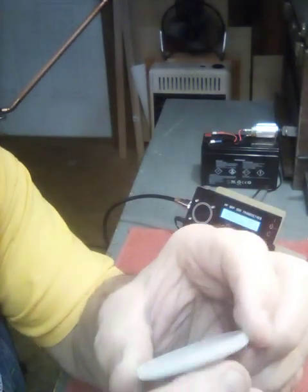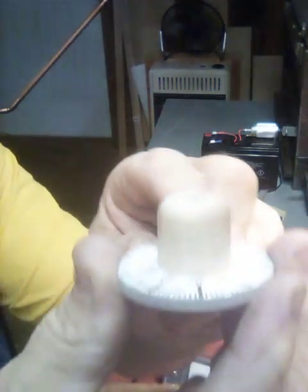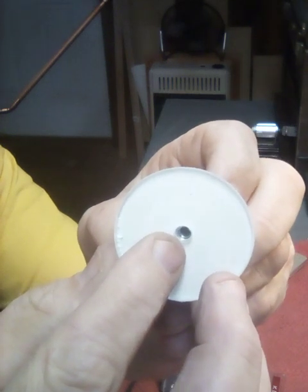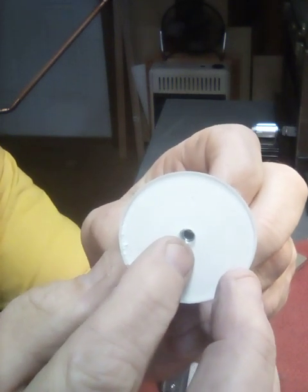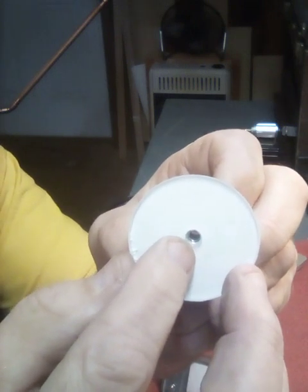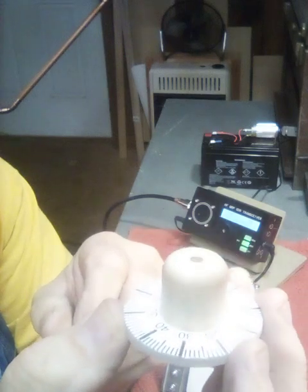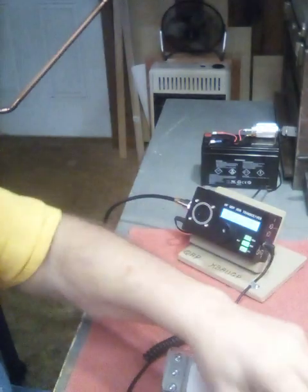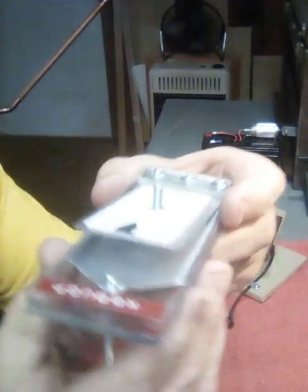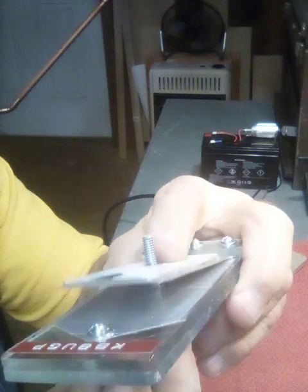I put that on her. The thing is, inside the wood here, you can see it — I got a nut in there. It's a lock nut with nyloc to keep this knob steady, because you got to have this knob pretty steady. Like I said, it's like a giant-size trimmer capacitor. That's all it is.